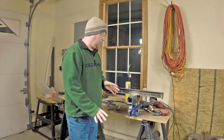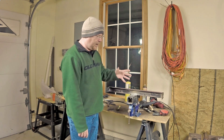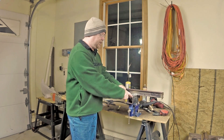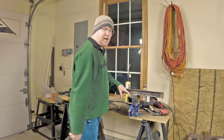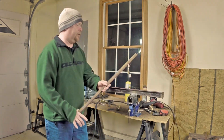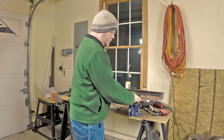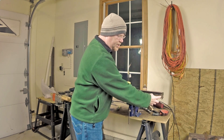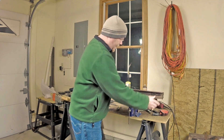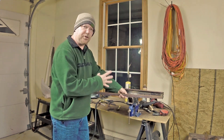Next on deck is to rig up some supports. I had originally figured I would just leave it and see what happened, but obviously I've got the geometry here to run iron from the back of the receiver tube to the back edge of this. There's plenty of room on the tractor and it's not going to get in the way of anything. So I'm going to take a piece of iron, run it diagonally, cut a slight bevel angle on the end, tack it onto the top, and have a nice diagonal brace to hold up the back end of the tube and make the whole structure a lot more rigid.